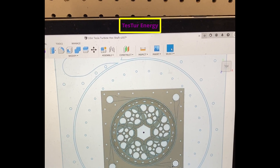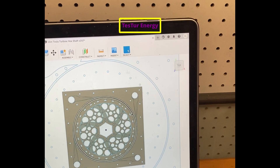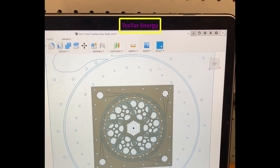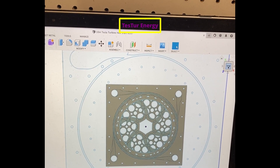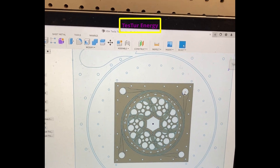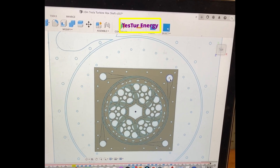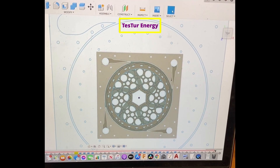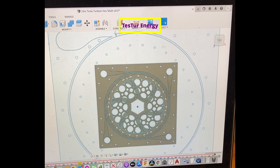I figure this is probably enough pressure, and if we restrict it so it doesn't need as much liquid flow, we can make the pump going from the condenser to the boiler just push through here. What doesn't make it into here can go straight to the boiler or the cold tank heat exchanger. You've already got to pump the condenser water to the boiler at higher pressure anyway, so we can use some of that work regeneratively to get this floating.